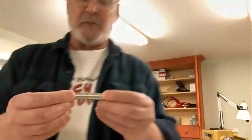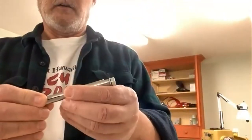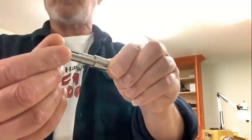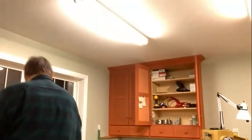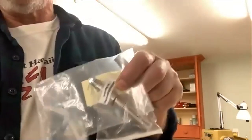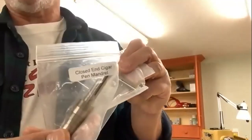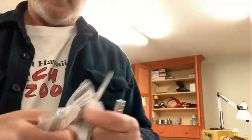These closed-end mandrels are pretty cool. For needle cases or similar pieces, you drill the hole and stick this thing into it, then put this into your collet chuck, drill chuck, or anything that'll hold it, and you can turn the outside. I've got four different ones — they come in specific sizes for specific pen kits: one for a cigar pen, one for a gentleman/statesman pen, one for a Baron pen. Same idea as a collet chuck.